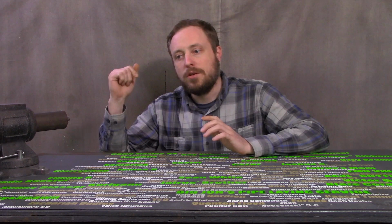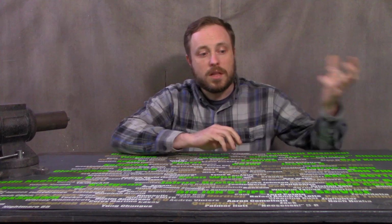So that meant that I had to wrap the handle with the inner and outer wrap first, then epoxy the guard and the blade, put those together, make sure that stuff was aligned, clamp it in place, then install the collet, and while everything was soft at the end still, I could install the pommel, because then the pommel would be epoxied onto the actual handle wrap, and save me having to sand it back and put more epoxy on it.